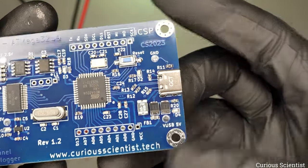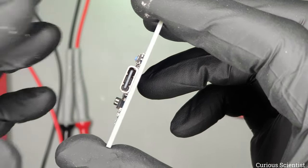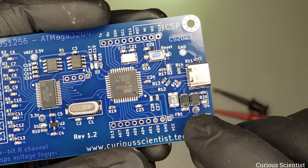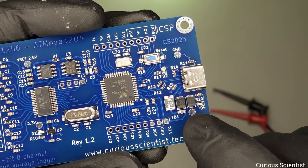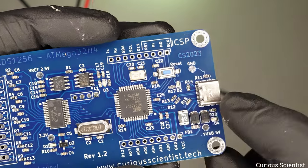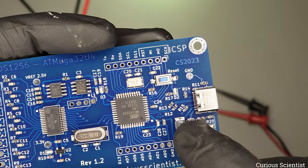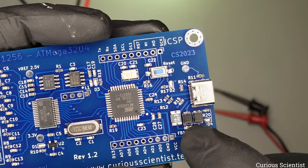To test the board you can do the following. Obviously I can just plug it in using the USB-C connector but I have another idea. I put a few tabs on this board — one is the ground GND and this is the VUSB, which is 5 volts. So I can feed 5 volts through this tab and put ground here to power the board. This circumvents the fuse and ferrite bead from the input voltage pin, so I directly feed the capacitors.